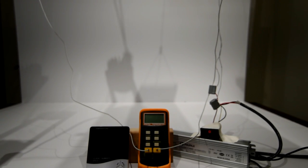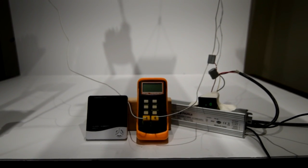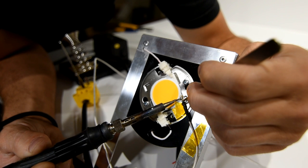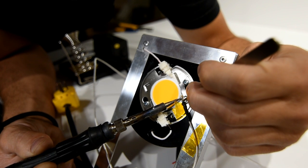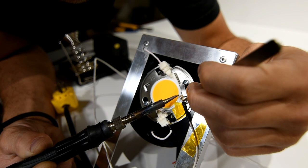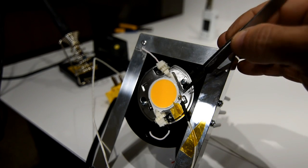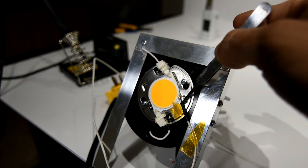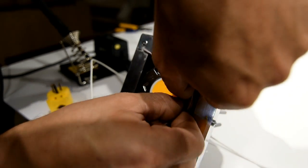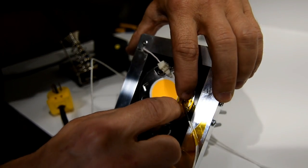The temperature measurement method was with two K-type thermocouples hooked into one digital thermometer, soldered directly to the crease. Soldering K-type thermocouples can be a real challenge, so a generous amount of solder was used to encompass the tip of the thermocouple. After confirming that my connections were secure, I added a little bit of Kapton tape over the soldering points to ensure that additional heat from the light-emitting surface would not affect my results.